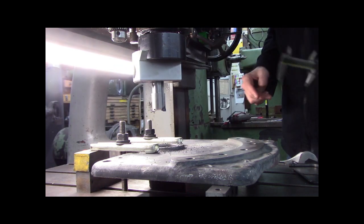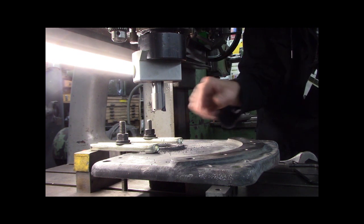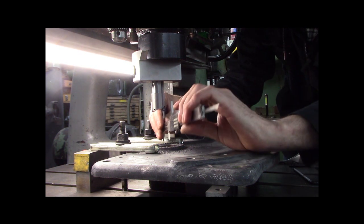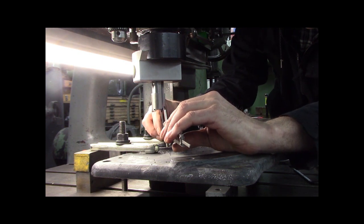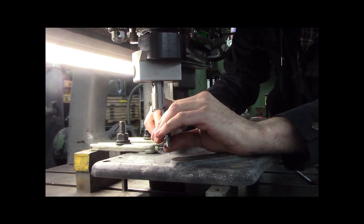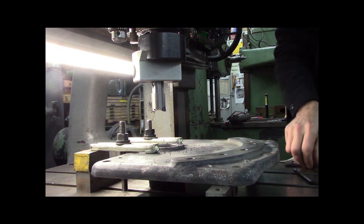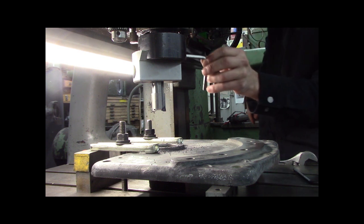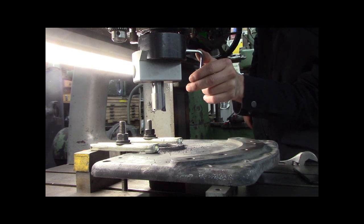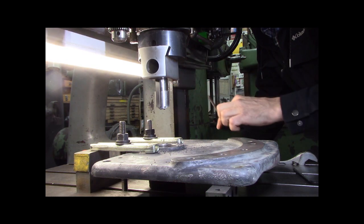It's a good thing I checked, because I'm like 10 thousandths away. So this is a radius graduated, apparently. Not diameter. A minus 8. Minus 9. Minus 8.5. Minus 8. So if I go 4, back this sucker up, man. I almost screwed this up. All right, so. Then. Maybe 3 thou.